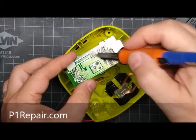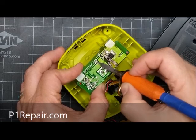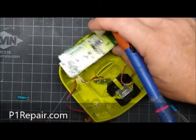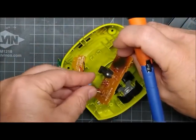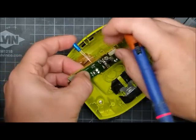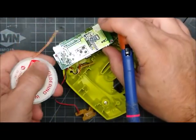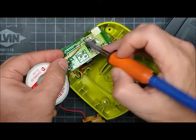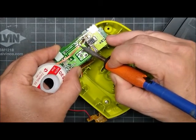You can't put the new one in because there's solder in the way. You might be able to heat it up and move it out of the way if you don't have any way of removing it. You could potentially tin the leads and then heat it up and push them in, but it's kind of tricky. I've got some desoldering braid — it basically sucks up the solder like a straw into the copper braid.